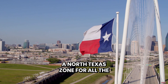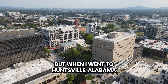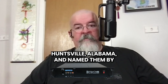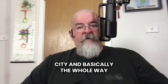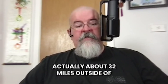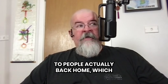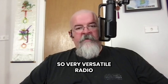If I go up to Dallas I've got a North Texas zone for all the DMR up there and a zone for all the analog. You get the idea. When I went to Huntsville Alabama for Thanksgiving I plugged in all the repeaters from Houston to Huntsville Alabama and named them by city and state, made zones for states, and basically the whole way I was talking to hams. About 32 miles outside of Huntsville I was able to hit the Monte Sano DMR repeater and talk to people back home who were on the same talk group.